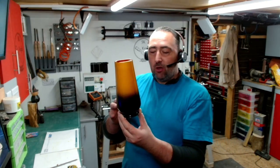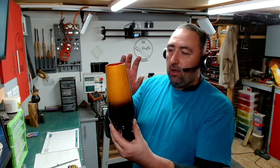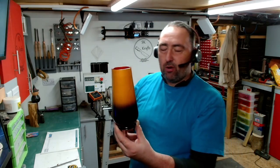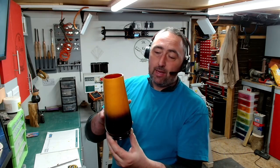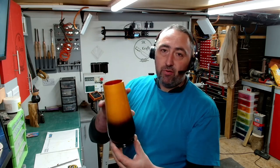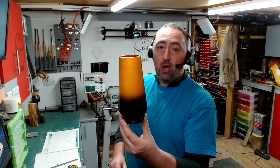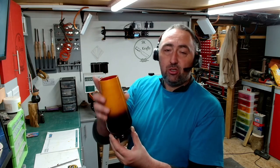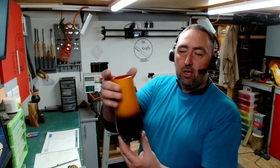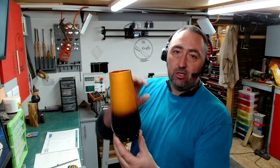And the lacquering is what's taking the time. Obviously, we've put 15 coats of lacquer over this piece. I believe I was doing 3 coats a night, then leaving it 24 hours to dry. Once the lacquer was on, we had to cut it back, which I did with 600 grit Abranet, then Yorkshire Grit original microfine, and then we burnish and cream over the top of that, and then a final coat of automotive car polish to give it the nice sleek silky finish. The good thing with the car polish is it doesn't allow fingerprints. Unless your hands are greasy, you're not going to get fingerprints all over it, and it also gives it UV protection, so hopefully if it's in the sun the colours shouldn't fade.